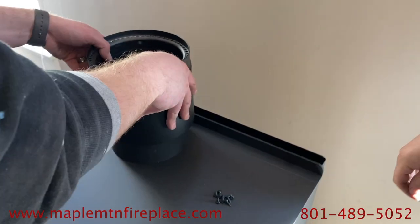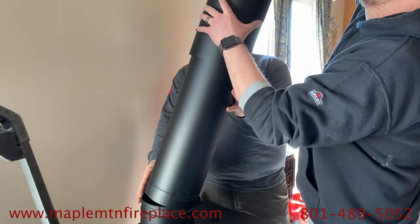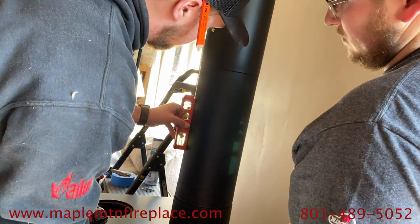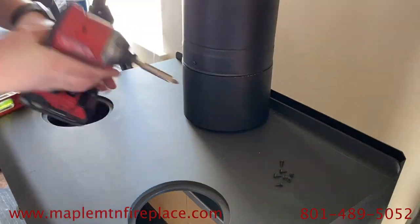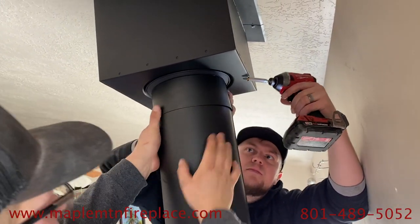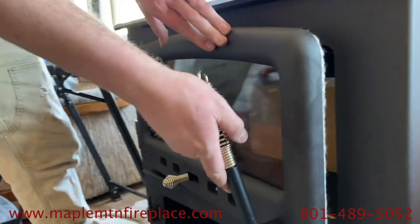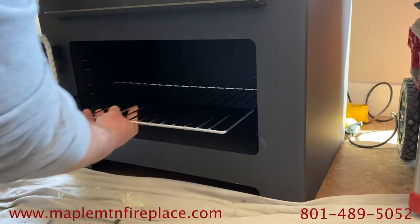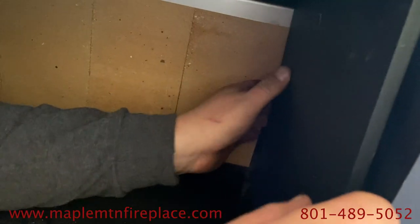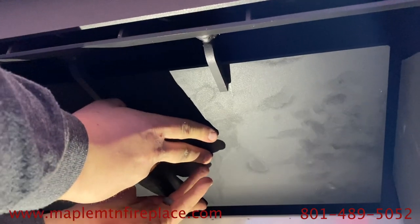So here we have our first section of pipe — this is our stovepipe adapter, flared on the bottom so it fits over the collar. Now we've got our telescopic pipe that we're going to connect. You have one guy hold the bottom, then push the top of it up, get it level, and put your screws in. Here's a collar designed to hide the connection of the double wall to the stovepipe adapter. Now we're setting up the stove — putting the doors on, the oven door for the bottom, and the adjustable grills for the oven. This is a side refractory that's actually a half-inch thick steel plate for each side and the baffle — it just allows the stove to heat up more evenly and efficiently.